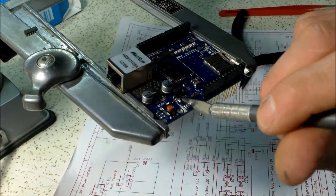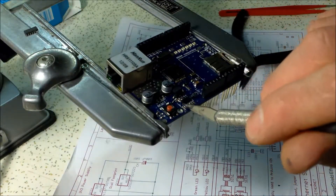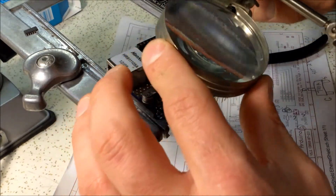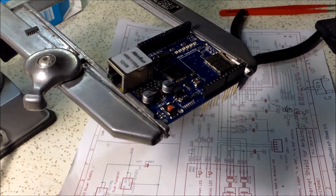Just checking if anything is accidentally shorted to ground. If you accidentally short it out you're probably still going to be okay - it just won't work the way you want it to. Take a little X-Acto knife and just check it. That's it. I'll take you off the tripod for a closer look. You can see the chip connected to those pins - it's connected to ground and pin 12 and 13.